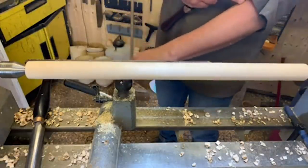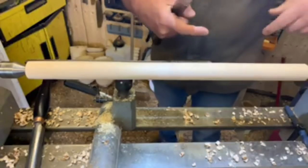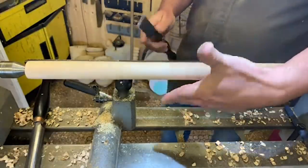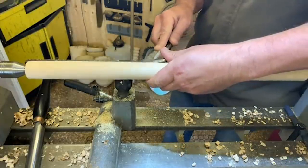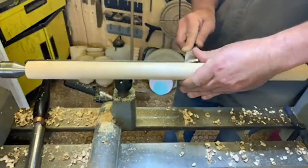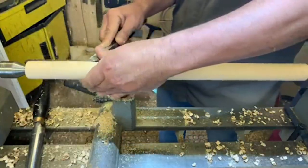I've got a short sleeve smock on, so I've got nothing on my arms that's going to catch in the lathe. I'm aware of what's happening at that end of the lathe, because I'm going to put my hand here. And I'm not going to put my fingers anywhere near the tool rest, those pinch points. Underneath, with my thumb just supporting the skew, I'm making a nice light cut, and there's my steady. But like I say, that's very much a practice cut. Don't break the piece because you'll burn your fingers.